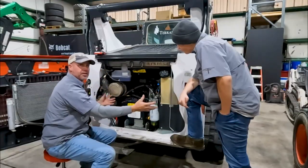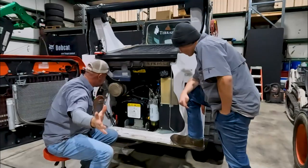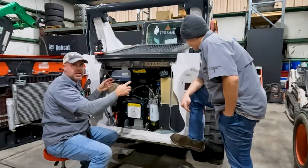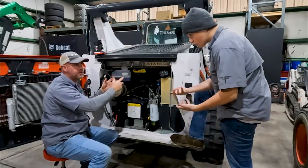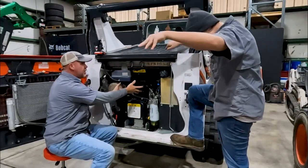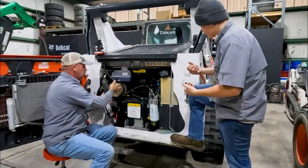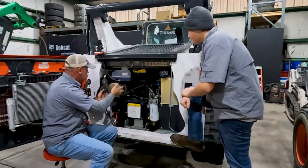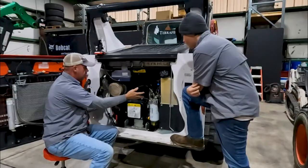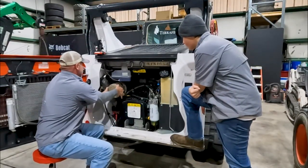Now this is like a giant vacuum. All your dirt and everything that you're stirring up as you're operating the machine is just getting sucked in through this door - actually getting sucked in up front of the machine. That's why the machines get so much dirt up in the front. So now we're sucking all that dust into the engine compartment, and our air filter housing is also like a big vacuum - its intake air is actually coming from the engine compartment, pulling all that dust into the filter.